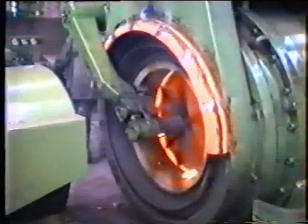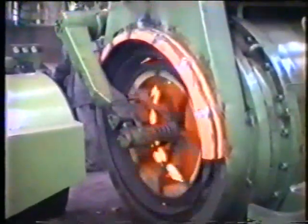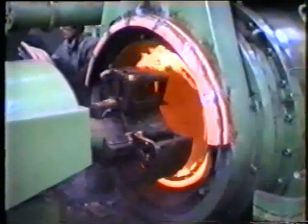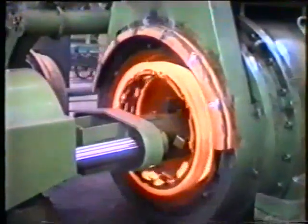When the pipe has cooled off a little inside the mold, the core insert unit swings aside and the pipe extraction tongue moves into the pipe. It spreads and extracts the pipe out of the mold. After that the casting machine moves backwards and hence the pipe is completely extracted out of the mold.